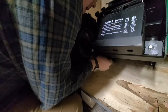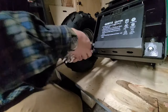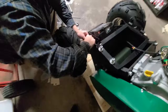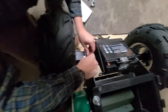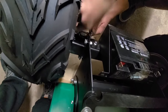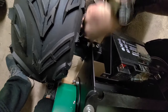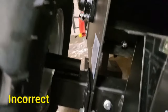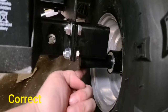There is the mistake — right there at the top. Do not have that on top when installing the wheels. This is the correct side, correctly installed. That little roundish axle thing needs to be on the bottom — we found this out the hard way. When we put it all together I noticed the wood chipper was leaning badly, so we had to take off the wheel and reattach it. My brother is attaching all four bolts — the axle on the bottom is correct.